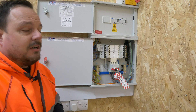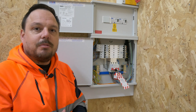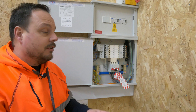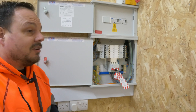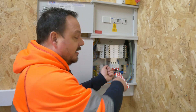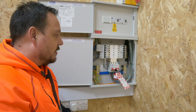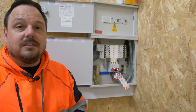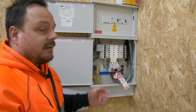If you had applied this lock during the course of trying to get your ZE and ZDB measurements, anybody who's coming in and around this board while you're not present is still going to have access to those live terminals. Actually, this is more a hindrance than a help because it's going to be in your way while you're inserting probes into the main switch. It's not going to give you a safe system of work. So if you've got your big rubber gloves on and your GS38 probes and you're busy working away in here, and you come into contact with the wrong piece of metal and terminal at the same time, you're going to have an issue. You've still got the live terminals exposed — it would be live working. Although you've applied a lock, the barrier's removed and live terminals are exposed.